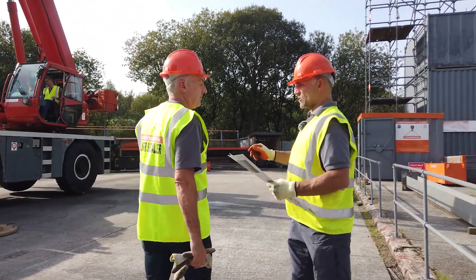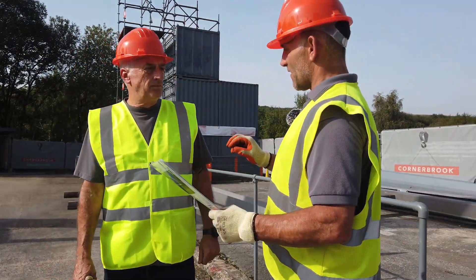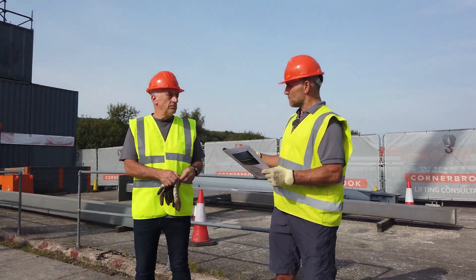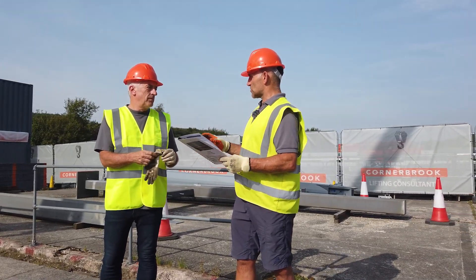Right Matt, whilst Graham's just setting his crane up, what I would like you to do is get the slings out that we discussed, check them. I've already identified them and confirmed that they're all in date — it's the two 1-ton flat web slings. What I would like you to do is double wrap and choke them on the tube which is just sat behind there, put a tag line on them. Any questions, give me a shout.